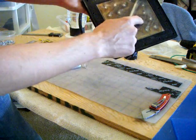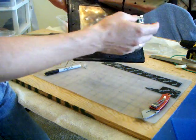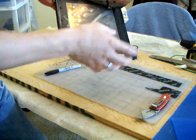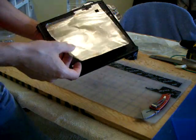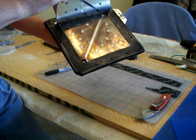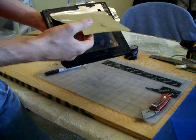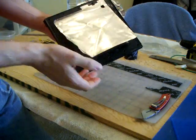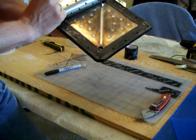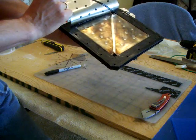The little clean spots you can see here correspond with the little spacers between each plate. Those spacers, I put them there. It's two layers of tape, because it's stainless steel foil that I use with my cell, which is way cheaper than a thicker stainless steel. But it's really tricky to work with. It's really flexible and it kinks. So to make sure of the heat and the thermal work that happens in the cell, I place a lot of spacers, which don't take much plate surface off for productivity, but they did the job.